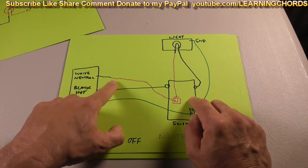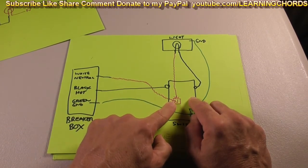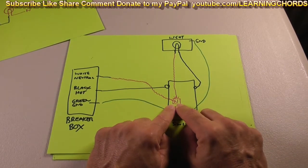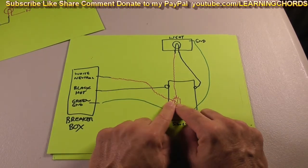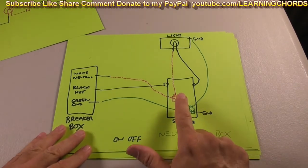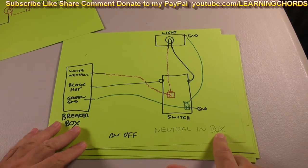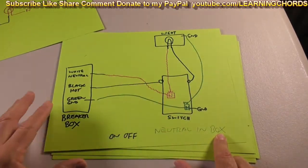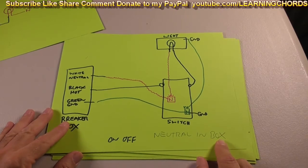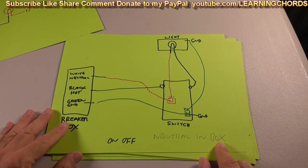Over here we have the neutral. The neutral goes into the box. It does not connect to the switch. It goes into the box, goes into a wire nut, that's WN that I put over there, connects over to the light to give you the power, and you have power to the light with the switch, which is over here, and you have a neutral in the box. Most of these, not most, all of the recent smart switches need a neutral in the box, or your smart switch is not going to work.